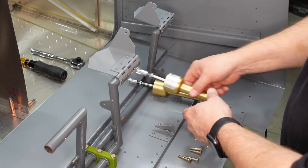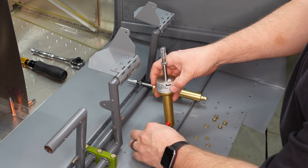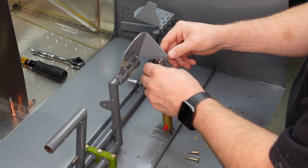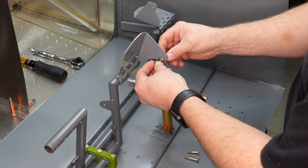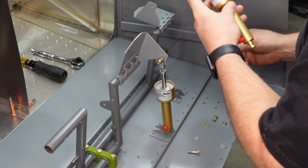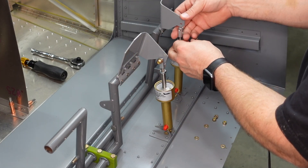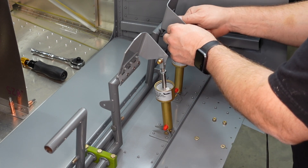These three bolts are complete. It was time for final assembly, so we got the cylinders out and the appropriate hardware out. I did end up shortening two of the bolts — they seemed to be a little bit longer. You want to keep that thread count in mind when talking about how many threads stick out from your nut. Make sure when you're putting in hardware with a washer that you don't have too little or too much bolt sticking out of that nut — you can always adjust those as needed. The bottom ones are pretty much final assembly; the top ones I'm just putting on so I can get everything fit up. There's a nut on the cylinder plunger that will allow you to extend those shafts up or down to adjust that rudder pedal to just the right angle. I'm putting the nut, bolt, and washer on so we can get everything tightened down and all the pieces and parts in place.